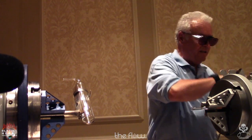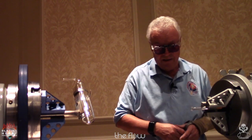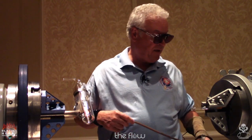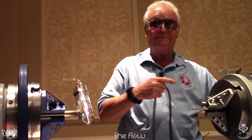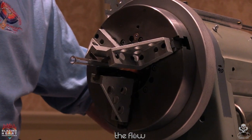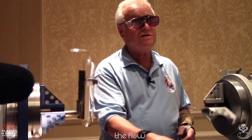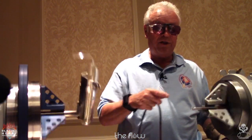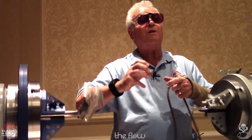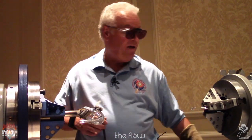Another tip I'd like to tell you while I'm setting the hose up here is these lathes, especially the Littons, will last forever if you take care of them. One of the best things to do is I always have my machine on. I have my rheostat at zero. So when I start it now, I can start it very gradually and it picks up speed to where I want it. Likewise, when I shut it off, I turn it down. If you shut it off at this speed, now you're going to turn it on at that speed, there's a jar to these splines on your drive shaft. Those splines are going to jam again. And through the years, that will give you a lot of wear. So I advise leaving the switch on and using the rheostat to do your speed.